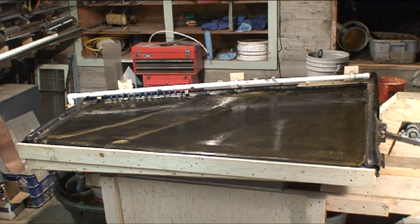We're going to run this with quartz that's probably in the range of 20 to 100 mesh. It has about five or eight percent heavy black sand in it, and we're going to show you the separation. The table does a really quite good job of separating the blondes from the concentrates. In another clip we'll show you up closer how the free gold is actually separated. So we're going to turn this on and get it going.